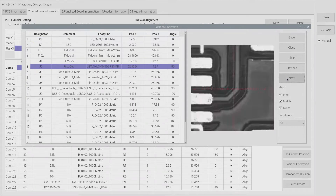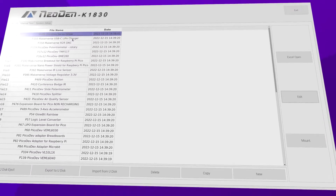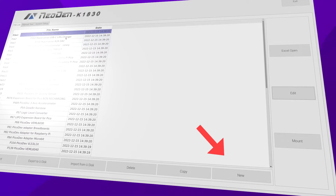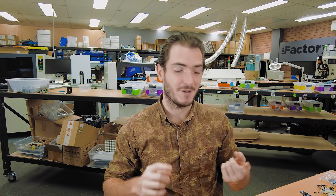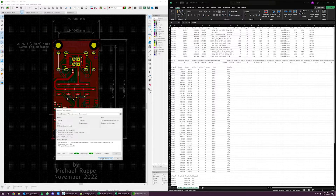The place file is essentially the list of component coordinates that tell the machine what to pick and where to put it - just a long list of coordinates. You can make the place file from scratch in the K1830 software, generate a new file and manually enter all your data, which is kind of painstaking. I much prefer to take an existing place file, copy it, rename it - that has the benefit of being pre-warmed with a lot of common components that we already use that are set up correctly. We know these settings are going to work for a lot of the components we use frequently.